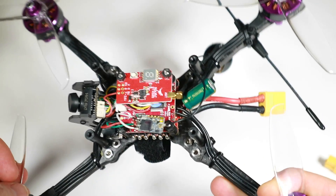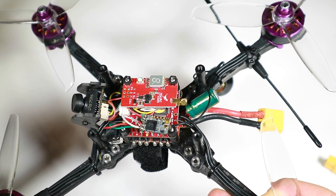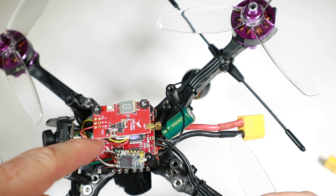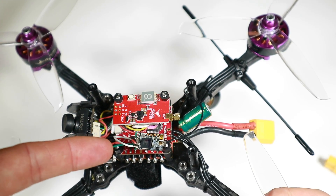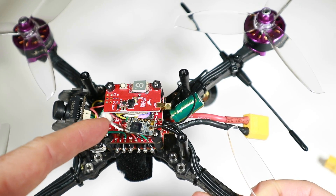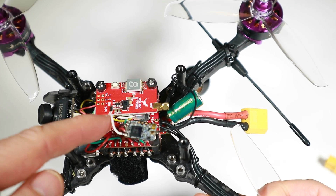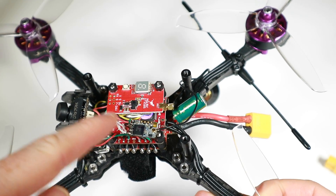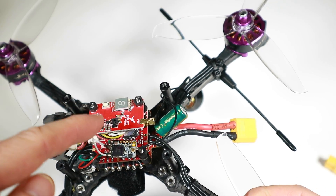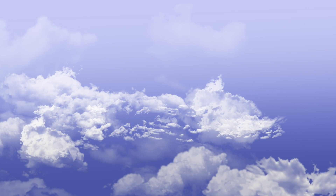That's the general gist of smart telemetry on the R9. But what if we wanted to add something else like a GPS and we've used up our last TX port? We need RX and TX for a GPS — what can we do? In the next video I want to talk about using a completely different pin for transmitting telemetry data using soft serial. I've got an LED pin here that I'm not using — can I use that with soft serial to transmit smart telemetry, freeing up the TX and RX pins for GPS? Next video.